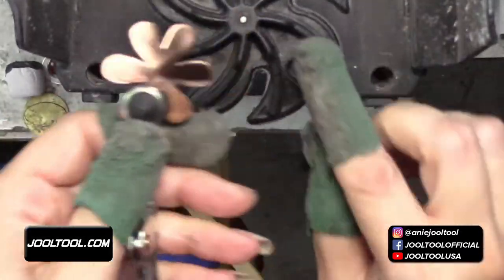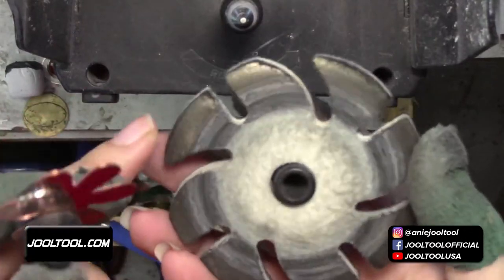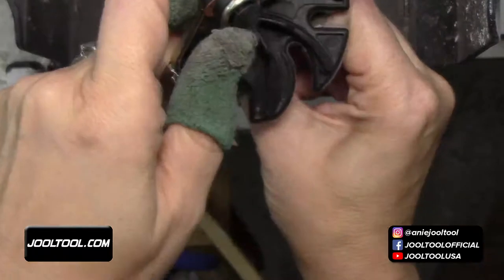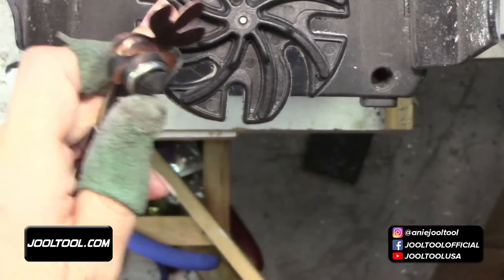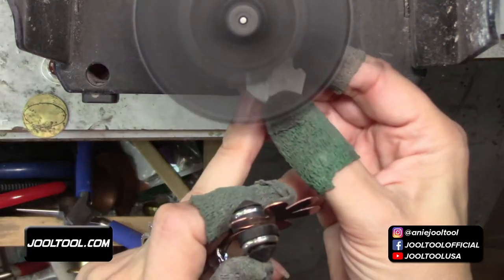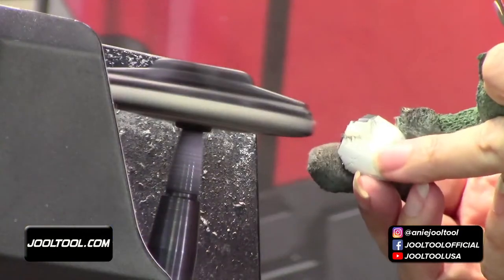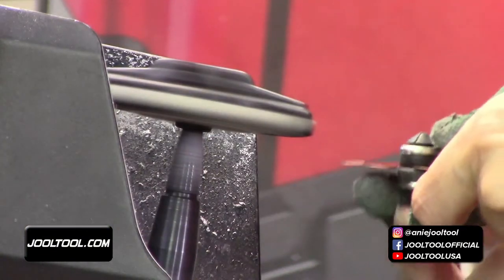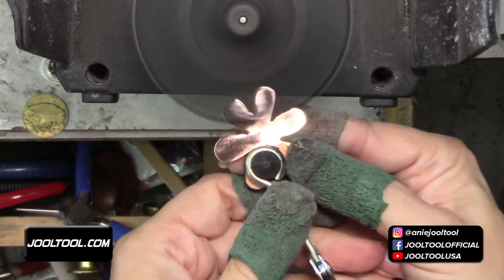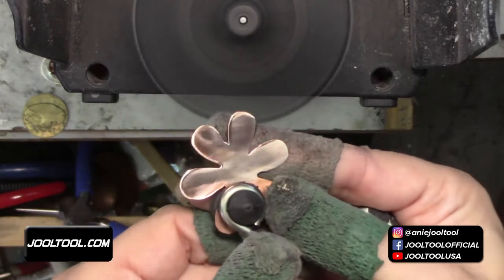And so if you're going to polish, remember, your polishing wheel should have a glaze, like a sheen to it after a while. It shouldn't be, well, I want to say, it shouldn't be too fluffy. Okay, so it should be like this. So look, I start more in the middle and I work my way out, even on the edge. So I do that and I repeat that a few times. So again, if I'm like this, change your scratch pattern, and within seconds, you should already get a polish. Do you guys see that polish?